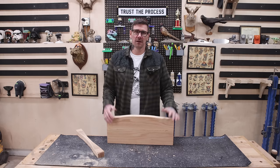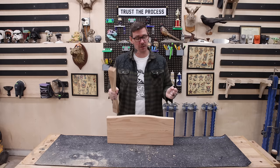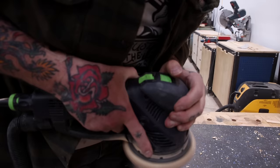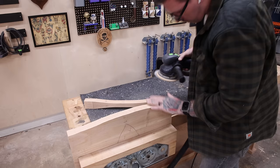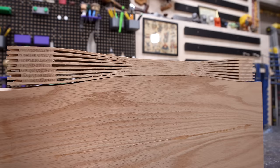I have a tendency to make things way harder than they need to be — I had an idea and didn't know how to execute it, just thinking I'd figure it out along the way. It's not working out on this one. I tried to scribe in the profile, cut it on the bandsaw, then thought I could flush-trim it using this as a template — you can't do that because it's the opposite of what we're trying to carve. So I threw it in the vice and tried to sand to my line with the Rotex, which is really aggressive. On this inch-and-a-half edge, it's really hard to keep it square the whole time, and it looks like crap.